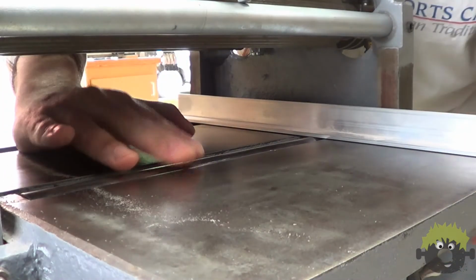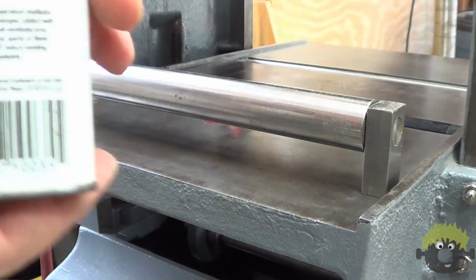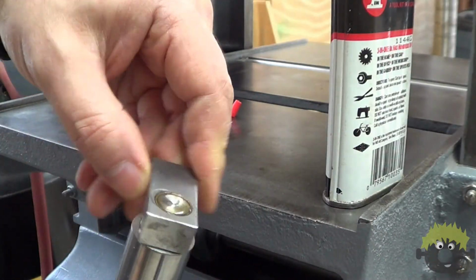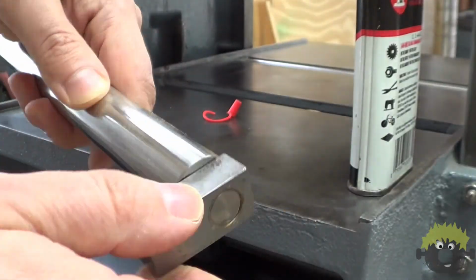Positioning the rollers is easy enough with the adjustment screws that are up under the bed. I used a straight piece of aluminum to see when the rollers came up high enough and locked the jam nuts after each adjustment. After they were all set, I then went back and lightly lubricated the bearings on both sides of each roller.